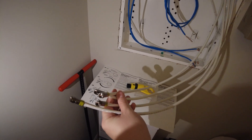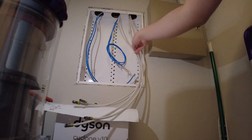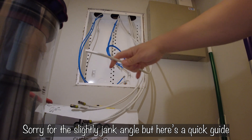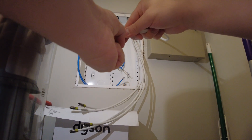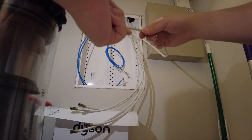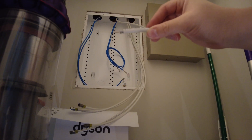I've already done four of the coax cables — stripped the ends and crimped the connectors on. Let me show you how to do the last one. Take the coax cable, insert it into the stripper tool, make sure it's snug, then spin it about four to six times, then spin the opposite direction, and pull it out. You'll have a nicely stripped cable ready to crimp.